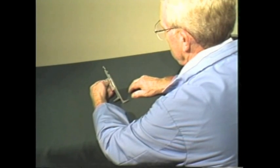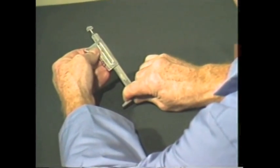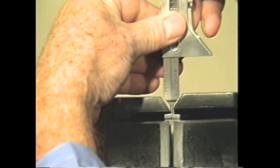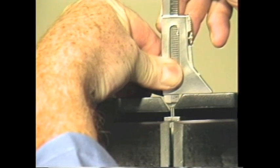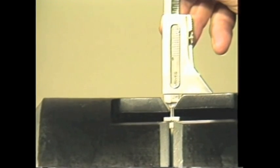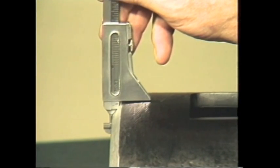This procedure can also be used to verify a 37 and one-half degree bevel angle. Before you insert the gauge, be sure to set the alignment scales to the zero position. Now place the gauge body squarely against the pipe wall and push the gauge as far as it will go into the fit-up gap. If the beveled shoulders on the gauge fit snugly against the bevel on the pipe end, you have the correct 37 and one-half degree bevel, common to most pipe end preps.